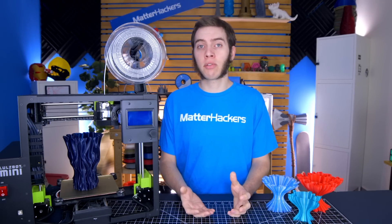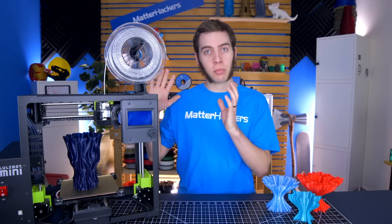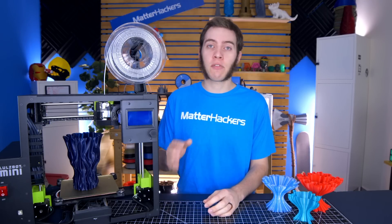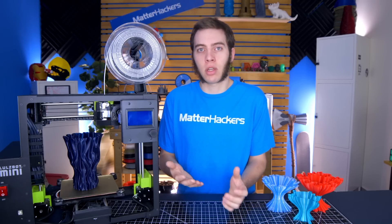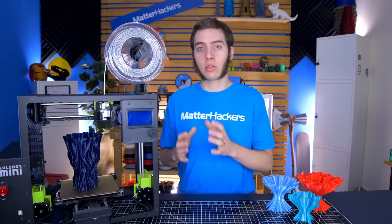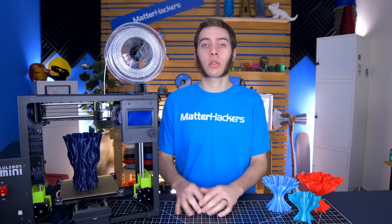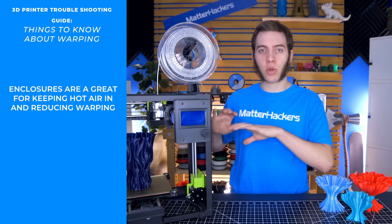It's also pretty important to have an enclosure over your printer. There are aftermarket kits you can get for a lot of printers — basically a big acrylic enclosure over the whole thing that keeps the heat in and any drafts out. A cold room is a terrible environment for printing ABS in. If you're in Florida in the middle of summer, that'd be a pretty good time to print ABS out in the open without any issue. It's kind of dependent on weather — if it's really hot, things print easily; if it's very cold, it cools the filament too quickly. Having an enclosure helps take all that guesswork out. You can do something as simple as a trash bag, or get one of those kits to keep the hot air in and the drafty air outside.